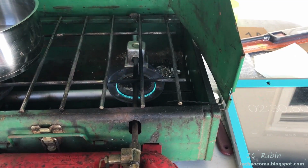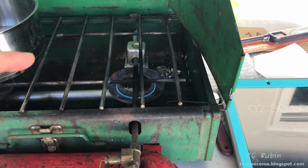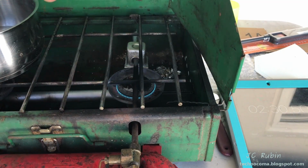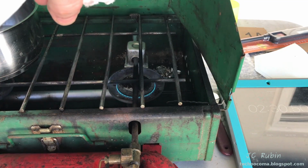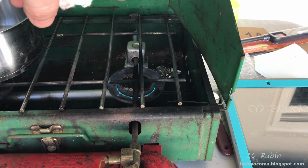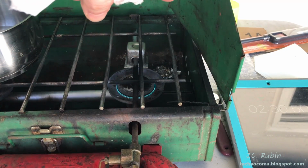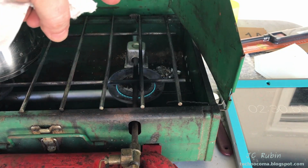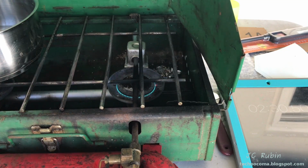So yeah, as it turned out, the kerosene performed really nicely. It didn't stink that bad once it got started. It was more difficult to light, but all I did, like I showed before, is I wrapped some paper towel in some tin foil balls, put it on the front and back of the generator. I had added some kerosene into those paper towels, which is what really stunk, actually, and lit it for a couple of minutes till it heated that pipe, and then off it was.